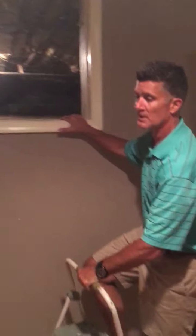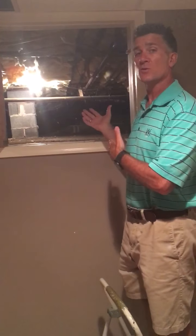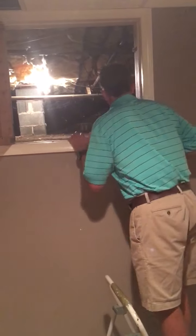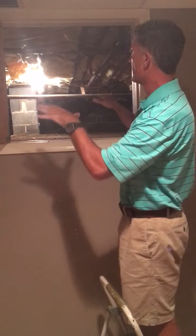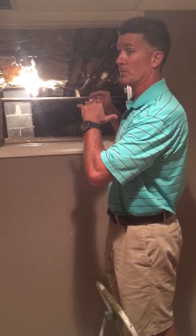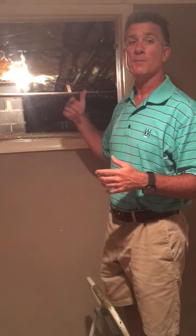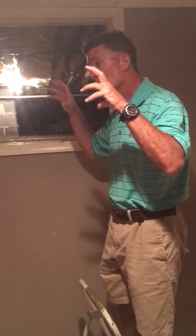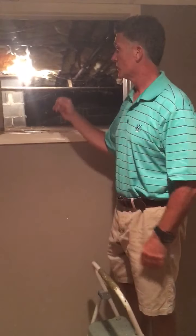What you want to do every once in a while, especially when it's inclement weather and it's been raining a lot, is go and just peek in your crawl space. Stick your head in there and see what's going on — make sure there's no puddles of water. There might be some dampness here and there, but you want to make sure there's no puddling of water. Every once in a while, pop that hatch open and look in your crawl space and see what's going on.